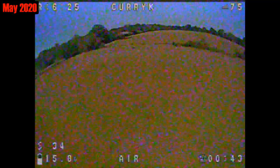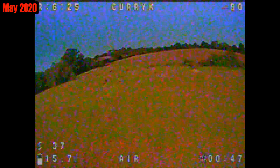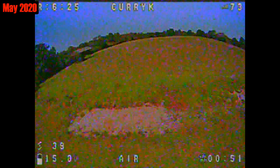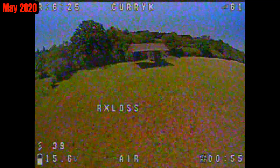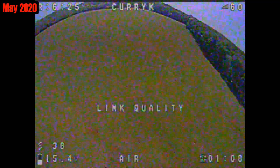Quite specifically, I had a bit of a range issue where, aside from the fact that the VTX wasn't fantastic, I was getting a lot of link quality messages popping up, and I actually had an RX loss on my maiden flight, which made me wary. But the biggest problem I was getting is motor heat — really, really hot motors coming back from the flights I was doing.